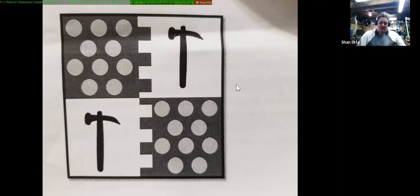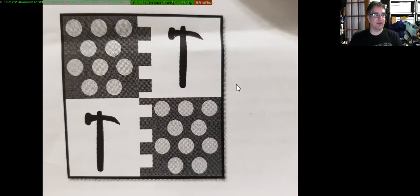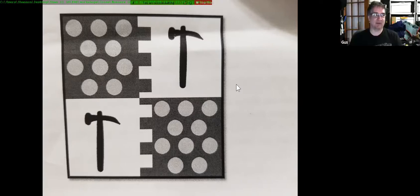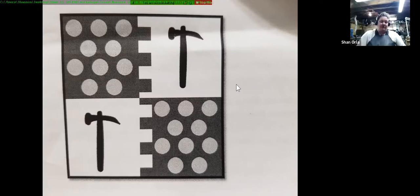There are folks out there in the Known World in the Moneyer's Skills Facebook group — please go there, their Facebook group is amazing. I've struck up to 500 coins, and I think Edward and Ryland are the ones I've done the most with. It's not a problem yet. If you're striking something harder like brass, then you might want to harden your die — but with tin alloys, whether tin antimony or tin silver, they're soft and mushy. Fine silver is beautiful; it squashes so nicely.